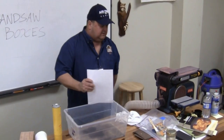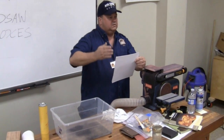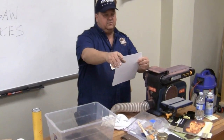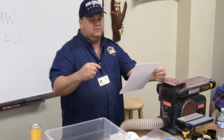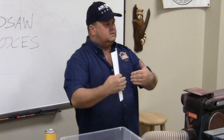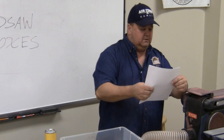Yeah, I want to look at a couple of notes that I sort of talked about during there. They talk about rounding over the drawers. Once you cut that front face off, they want you to round over that front part where it's at, a little bit. But when I've done that before, I didn't like it, it wasn't a clean cut between the front and the back. If you round it over on the inside of the box, you've got a shape like this instead of a nice clear cut. So I didn't like doing that. It was another thing that I don't do.